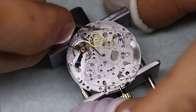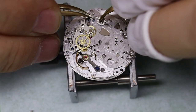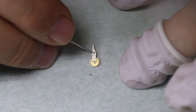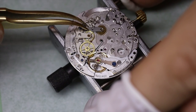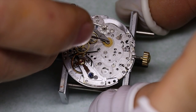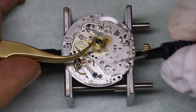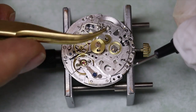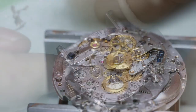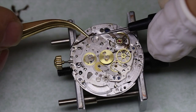One of the typical questions you get as a watchmaker or advanced enthusiast is how do you remember where everything goes. There's a very clear logic to it, and the main thing to remember is where the screws go. What I've done on this movement, as seen in other chronograph videos, is put the screws back in their screw holes after taking them off the chronograph parts - that really does help you keep the screws where they should be.